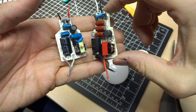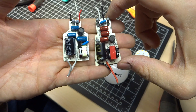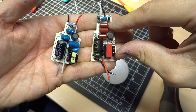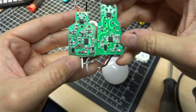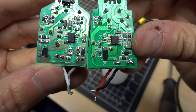Comparing this power supply to the last 60 watt one from Dollar Tree, they seem pretty similar. The number of parts is very similar, other than this has a transistor and the previous one doesn't, so this potentially is actually a cheaper design. The previous one does have a MOV on the input, which is potentially a little bit better. The last one was dimmable, but the controller definitely looks different. Both of them are unreadable when it comes to part numbers.